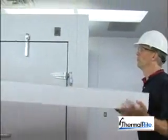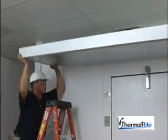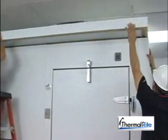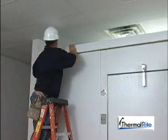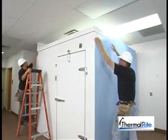Place the last ceiling panel on top of the walls, then cam lock to the matching wall panels to complete the installation. When installing the last ceiling panel, if the fit seems to be too tight, it may be necessary to go back to the adjacent wall panels and uncam the locks. This will allow you to easily insert the last ceiling panel.